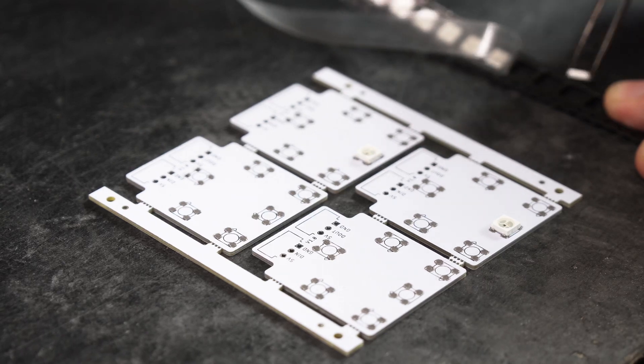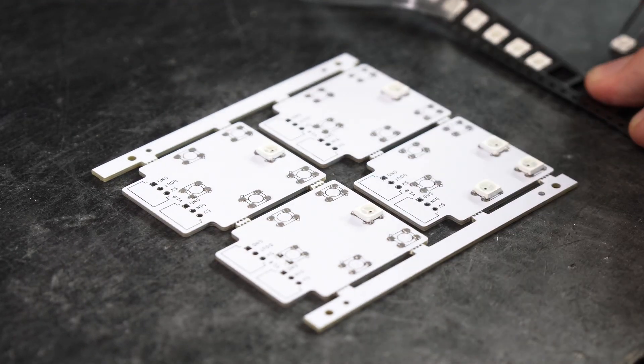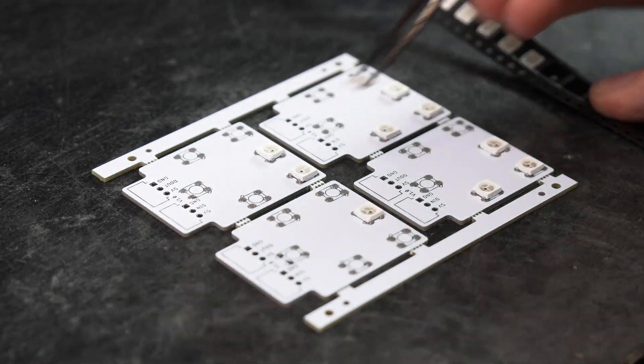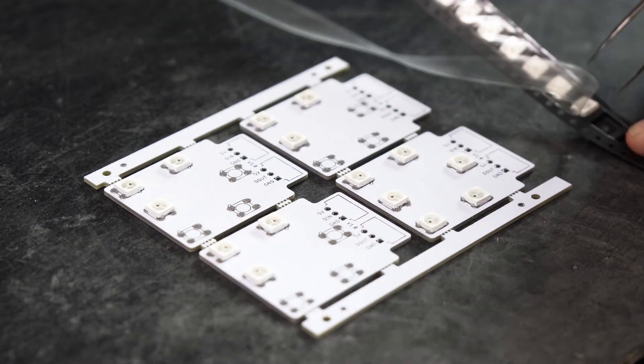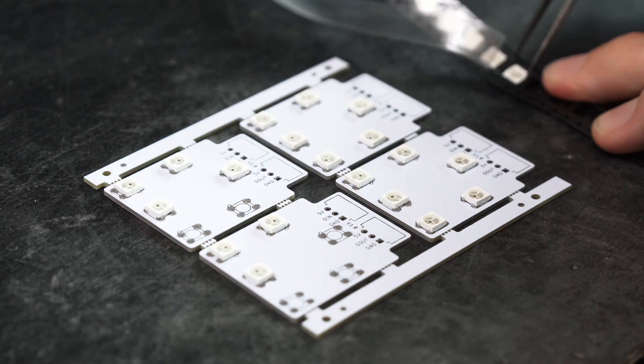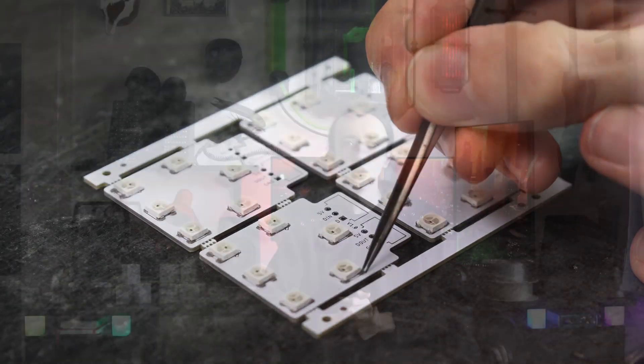Instead of just hand soldering some random LEDs that I stuck into the 3D print, I decided to make a proper PCB that I could then integrate and use cables with proper connectors in between them, so that it would be reliable and also easy to scale up. Since I had used the NeoPixel addressable LEDs in quite a few keyboard projects before, it was a no-brainer to use them, as they give me super good control, allowing me to have a bunch of effects while being very easy to incorporate into any design. There are plenty of off-the-shelf controllers available for them as well that give great functionality at a very low price.